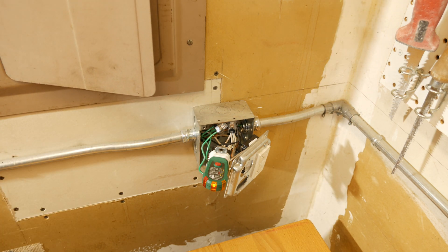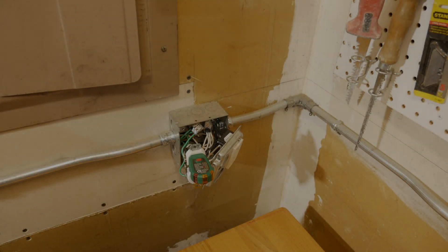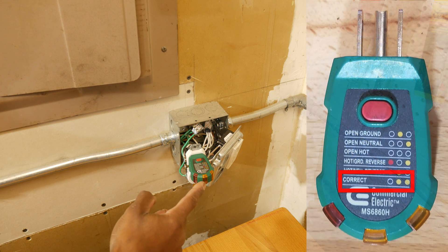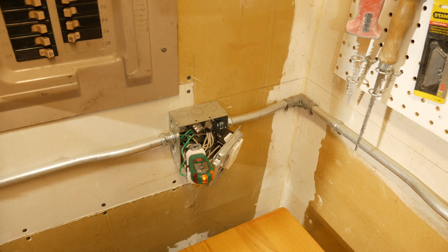In this situation we have the outlet perfectly wired up. I'll flip on the power, and we should see the two yellow lights come on, telling us we have a correctly wired outlet. Power is on — and as you can see, the two yellow lights are on. That's all good.